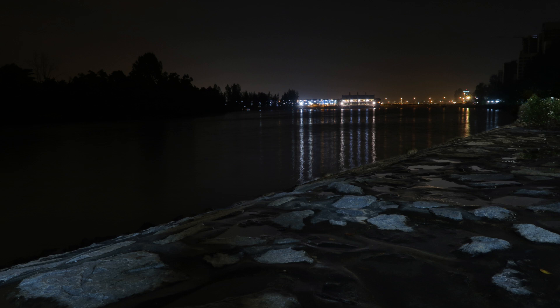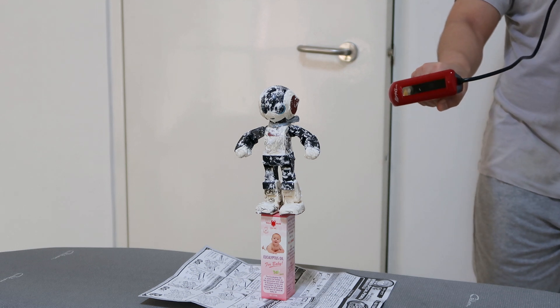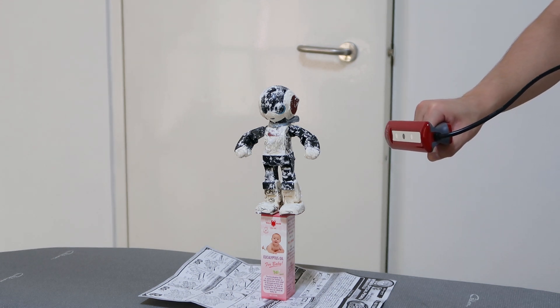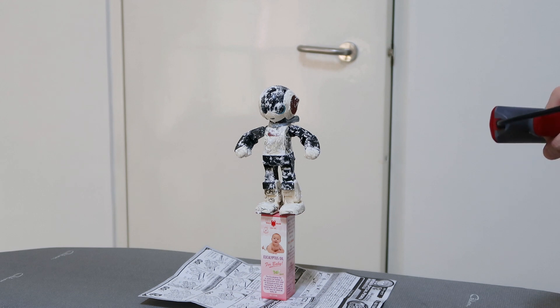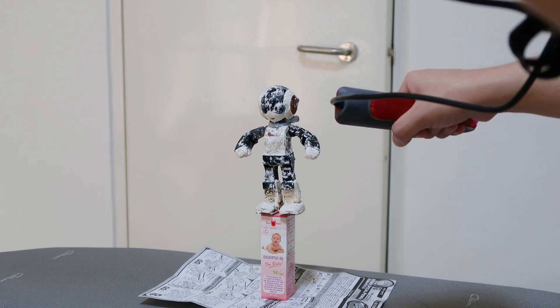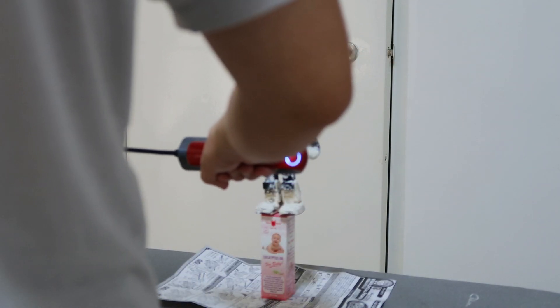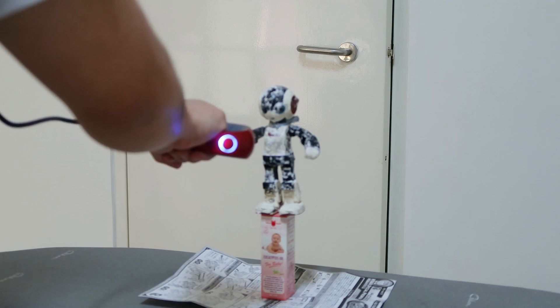But for most consumer purposes, let's do a few scans and see the results. The reason I have to do several scans is because results from consumer-level 3D scanners are usually so bad and unusable that you have to do it a few times and pick the one that's actually usable. 65% of the time, the reason people get terrible results is because they did not specify the scan area and mesh density beforehand. If the scan area is too large, mesh density gets spread out and detail is nearly non-existent. If density is set too low, there simply aren't enough points to describe your object's detail.